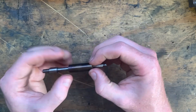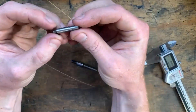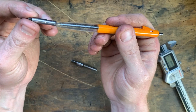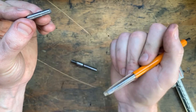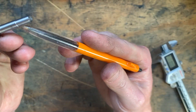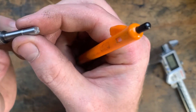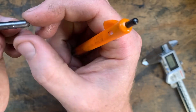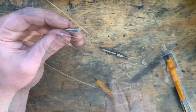Here are the two parts — the surface finish is a bit different on each one. For the first one I used a hardened turning insert and it needed a bit of emery tape, ended up pretty average. The second one I used an aluminium insert and it was beautiful — I could even take a spring pass at 0.01 millimeters and still make a clean cut without any rubbing.